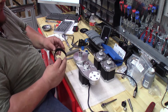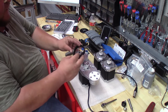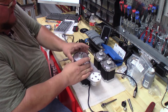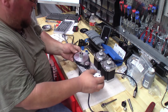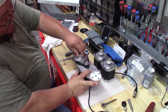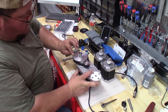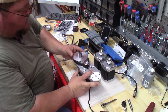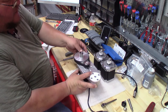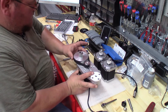You're going to get this belt here, and there's no specific way shown to run it. All you do is bring this motor plate — that's why you leave it loose — go ahead and get it in the groove here, slide it down, and make sure that belt is seated correctly. Make sure your belt is seated in the teeth right, that you're not missing a tooth and leaving a gap. If you miss a tooth and go to tighten it, you'll see a gap left there — you don't want to do that. Make sure that belt is seated in there correctly because you will regret it if you don't catch it.